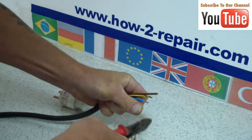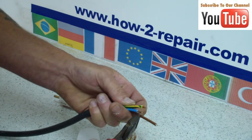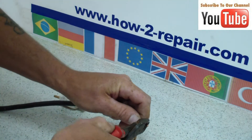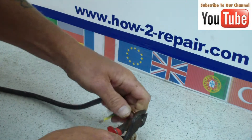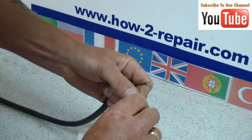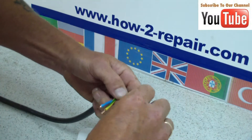If you are using an appliance or an electrical item with a plug, you need to check the fuse ratings firstly. And secondly, make sure you are using adequate sized wire. For example, you would want to be using at least 1.5 for something like a kettle, going up to 2.5. But do consult the manuals for this, as the appliances will be fused to certain ratings.